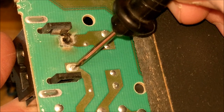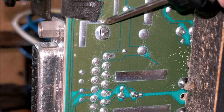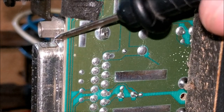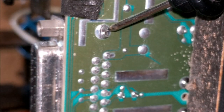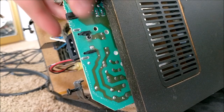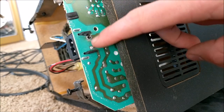It may be hard to see, but that shows the solder joints here are not good. I can show you an even better example if we slide the device up to this connector — you can see how bad the solder joints are. This is horrible because it shows how poorly the soldering was done on this device. If it had been properly soldered, or even if they had used good solder, an issue like this would never happen — especially on a connector where someone is constantly pushing a cord in and out. They should have used extra solder here.